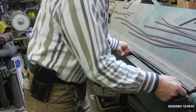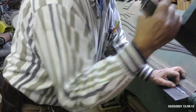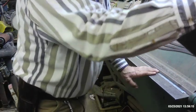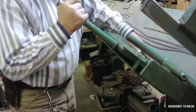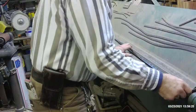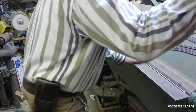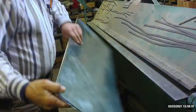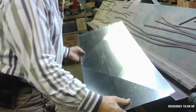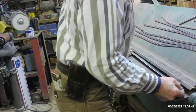Time to put our half inch double hemmed flange on it. If you use heavy enough material - typically 24 gauge on a residence - you don't even have to put a double hem flange on it. This is 26 gauge material, and 26 gauge with a single thickness fold will buckle when you try to run a screw into it. So I bite the bullet and make a double hem flange - I never have a buckle, never have an issue, and that's the way I like it.